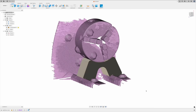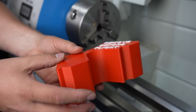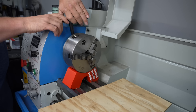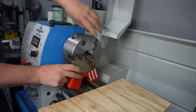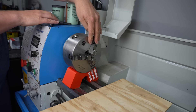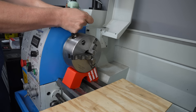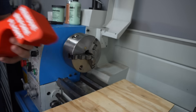I put it into Fusion 360 and used that geometry directly to solid model the part — I didn't measure anything with any kind of gauges. After 3D printing it, which took about two hours, I dropped it right under the chuck. When I remove the cam locks it just sits right on there, and then I can slide the whole thing out supported without relying on my hand. This is really the power of 3D scanning to capture complex geometry and model parts right off of it.